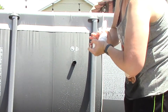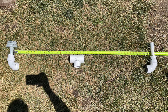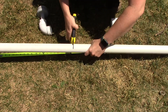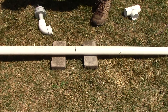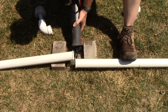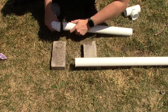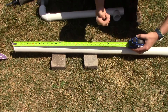Your 90 degree elbows are going to go right on that adapter on both sides. I laid out my PVC piping on the ground to those distance dimensions to help me figure out how long the PVC pipes need to really be, since I need to account for the T and the elbows. I thought it would be fun to try using the PVC cutter on one and a half inch thick PVC — I knew that wouldn't work. This is how I choose to cut PVC pipe: I like to use a hacksaw. This blade is all purpose — it is designed for PVC as well as wood. After every cut I take sandpaper to the edge and smooth it down, getting all those loose filaments from the PVC gone. We want clean, nice ends on our PVC piping. I repeat the process for the next piece — measuring out the length, marking it, and then cutting with the hacksaw.